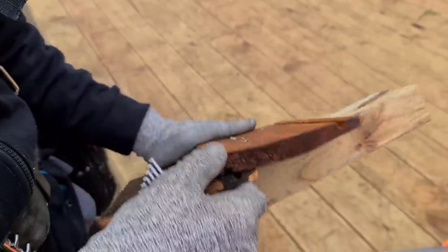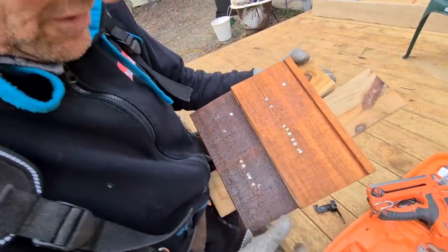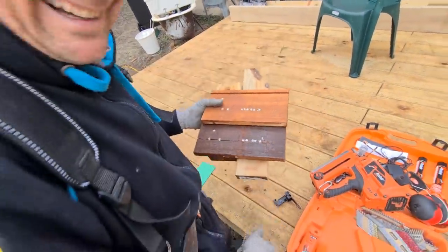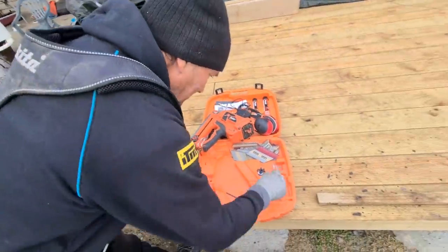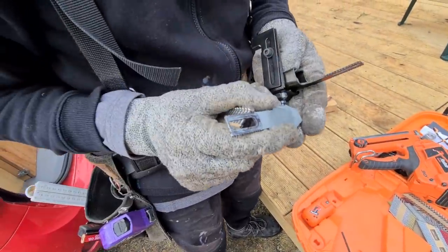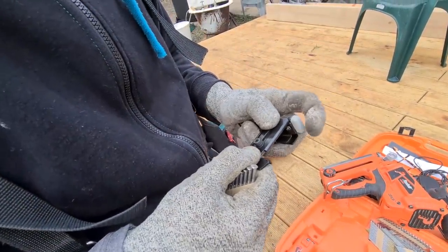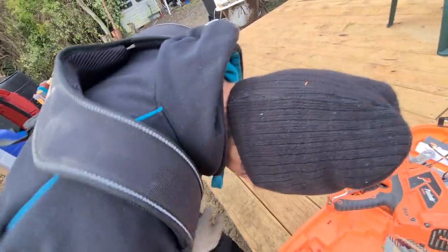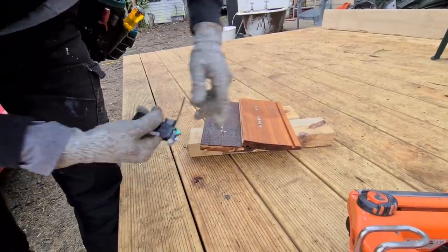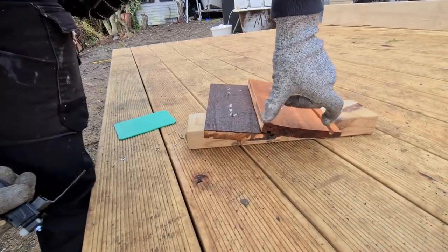That little colour is almost a coating that generates a little bit of heat and glues itself into the timber. I've got a full round head — they're not a D head or anything — and they're exactly 65 mils. These are what we want to bang the weatherboards with. I'm taking my usual tip off, which is for framing. This tip goes on now — it's got a rubber bumper, it's called a no-mar tip, so I don't leave any marks on the timber, and it's got a depth set so I get it consistently at the right depth.